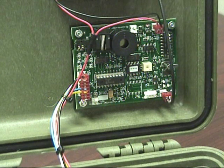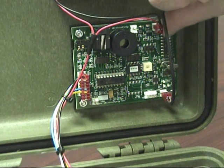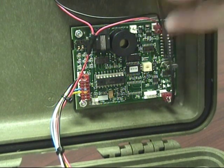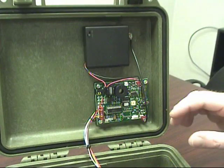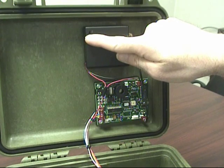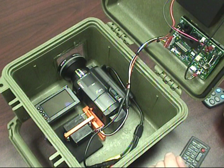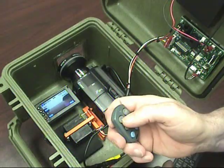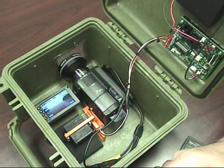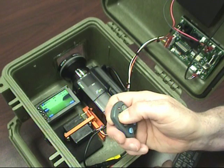Before starting the system, we recommend testing the night shot switch engagement by putting it into test mode. To do this, put switch 7 and 8 up on the DIP switch of the controller board. Once set in test mode, simply power the unit on — you'll hear a series of beeps. When in test mode the camcorder will be powered on; press the on button once. You'll see the servo engage the night shot button, and you can continue to press this to make sure your alignment is right.